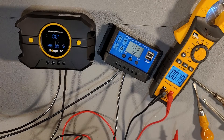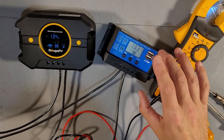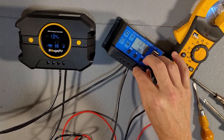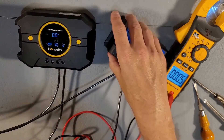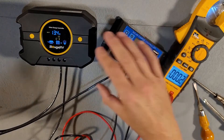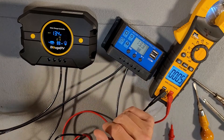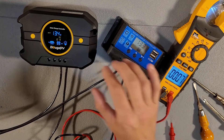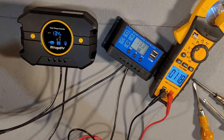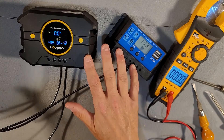I just wanted to give a little comparison between the $37 PWM charge controller and the $13 one. The cheap one feels like a plastic toy with very small connections, while the BougeRV is a lot beefier — easily twice as heavy — with a nice metal heat sink in the back and a color backlit display, which is nice if you need to check it at night. Voltage-wise, the BougeRV reads 13.4 and the cheap one reads 13.3; my multimeter says 13.33, so both are fairly accurate.